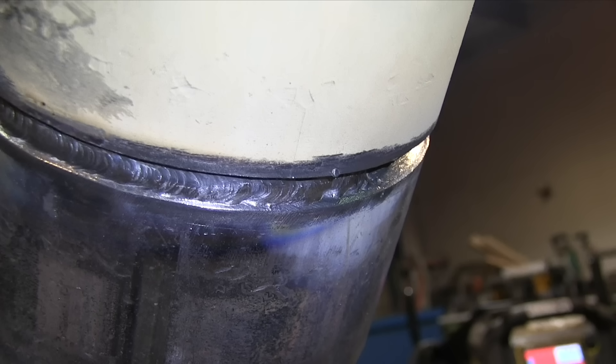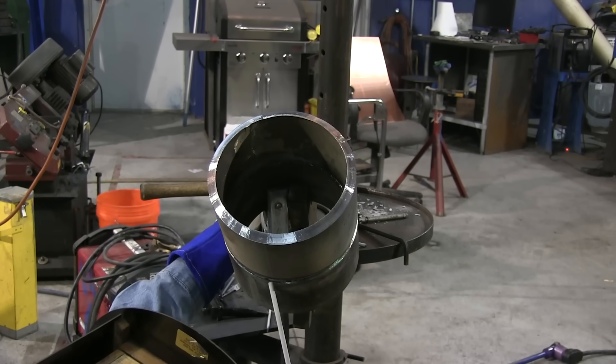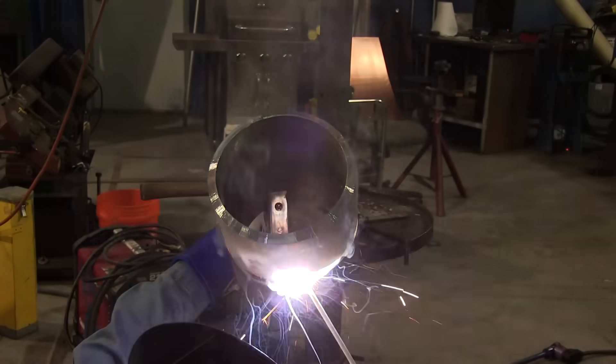For the first couple of inches of this side, Andrew didn't quite fill it in, so on the bottom he's going to overlap that bead by a couple of inches. Then when he turns the corner and starts going uphill, there won't be any trouble filling in more. He's overlapping right here — coming up on the start of that bead. Then gradually turning the corner as you go uphill, you can carry more metal. He's making a counterclockwise circle, backing up into the puddle just a bit, trying not to chew those corners of the bevel off so he's got a good straight guide for the cover pass.